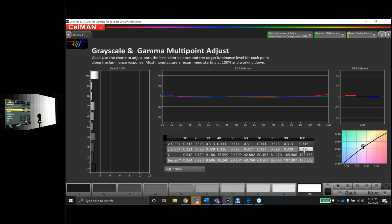So if we go color temp, okay, we'll go to green gain. Oh, sorry, gain blue. We'll pull up a 100 test pattern. And by maybe adding a click of blue, we might get rid of that 330, which would be pretty cool. But let's see. So let's add a click of blue into the top end. Three, 329, boom, 328 actually. So 2 clicks, easy fix.